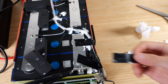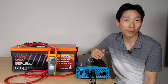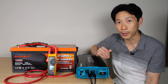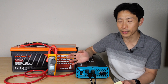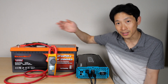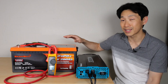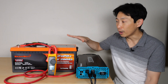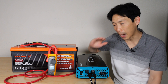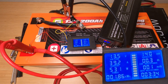Now to glue these back together — putting them temporarily until the glue cures. Just so you guys know, whenever I do these charge tests I don't waste the electricity — I dump it into another power bank, with about 20% conversion loss going from one battery to another. Much better than burning it off in a heater, especially in summertime. I discharged this battery and got a capacity of 212 amp hours — 106% of the rated capacity. I discharged it pretty hard all the way down to 10.2 volts, and dumped the energy back in to get 208 amp hours.